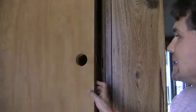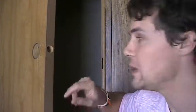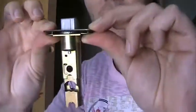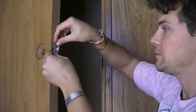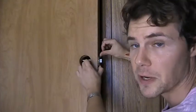Now realize what the problem is and where it comes in: sometimes these inserts right here, for where the latch is going to go, they're not big enough to house the entire latch. This is typically what you're going to get when you buy a Kwikset. You're going to get this latch and put it inside here, and when you try to close the door, it's not going to close — you're going to have a problem there.